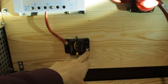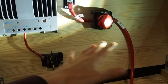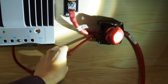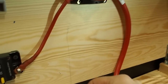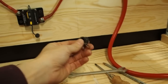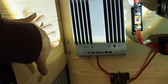Next I want to make a connection from the breaker of the solar charge controller to the switch — and I want to stay after the switch so that if I turn off the switch, both the inverter and the solar charge controller are disconnected from the batteries. I've found an old wire to attach to the back side of the switch and then we go to this bolt. You can use cable clamps if you want, but these wires are super tight so they're not bending anywhere.